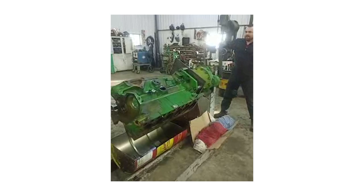You can't beat the sturdy and versatile engine stand created by Jacob Davis. The heart of the stand is a salvaged final drive from a combine, bolted to a 16-inch salvaged I-beam. Further support is provided by a piece of half-inch plate steel, and the engine mount is a 5/8-inch plate equipped with mounting bolts.